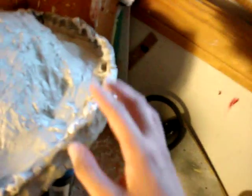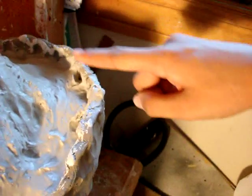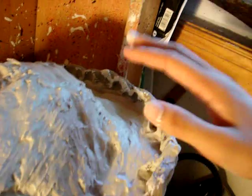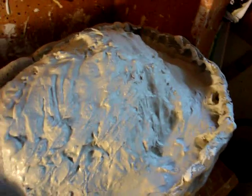When you're making the final coat, make sure that the plaster reaches up to the point that meets the containing wall. As you can see, there's still some empty space, right there. So what you need to do is fill up this whole thing with plaster, and this applies to the final coat. It should fill up to here. As you can see, it's a bit small when I made mine, but that's fine. As long as you make it sturdy enough once it's dry, you're good to go.